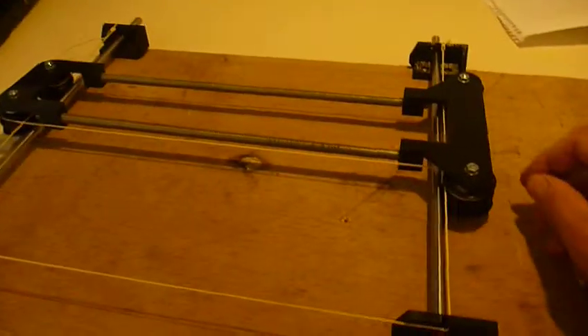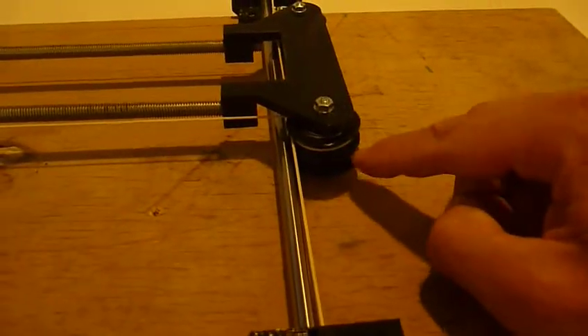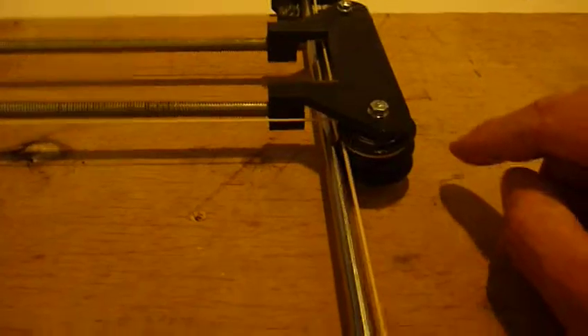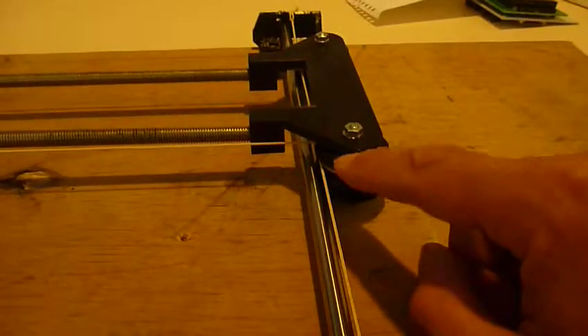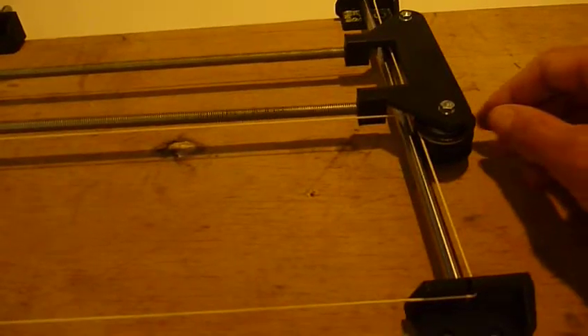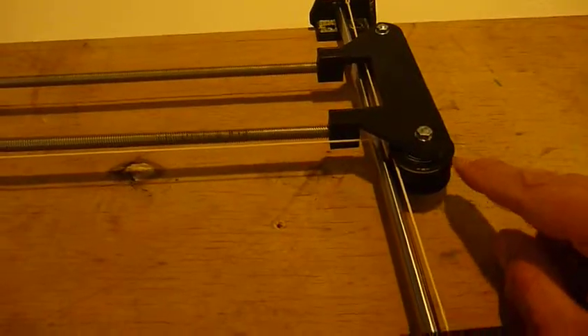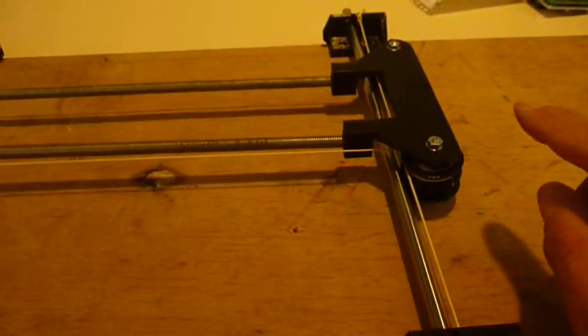What I don't like about this is that I made it here with ball bearings and printed some kind of pulley on it. If this pulley is not perfectly straight on the ball bearing it starts wobbling, which means the whole X position is going to wobble as well. And of course these are also not perfectly round. In other words, like this it is a bad idea.